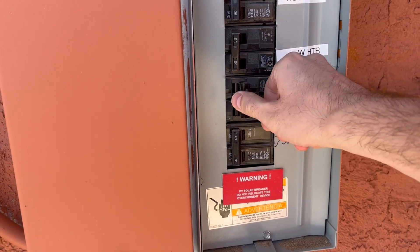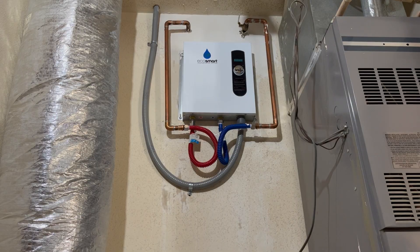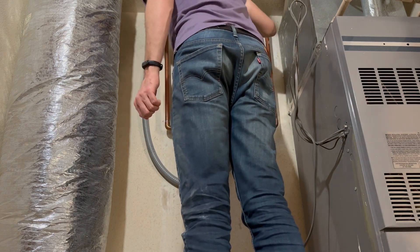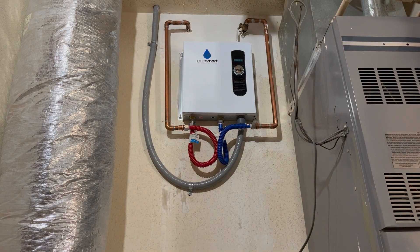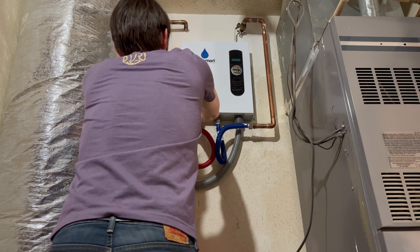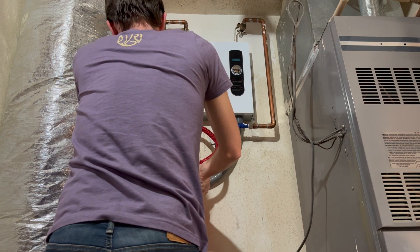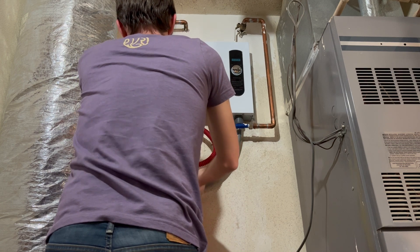To start, as always, I cut power to all three circuits of the water heater. Next, I cut the water supply to the heater. After that, you can open a hot water faucet in the house, like a bathtub, just to drain out the extra hot water and break the vacuum in the water heater. Then it was time to unhook the flexible hot and cold water supply lines. You'll want a pan or a bucket to catch the water that drains out.